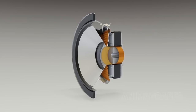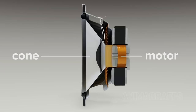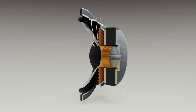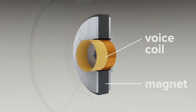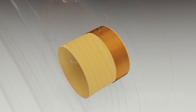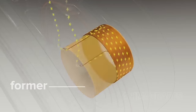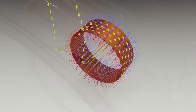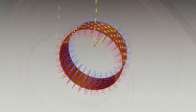Now that we've touched on the basics of speakers and studio monitors, let's get familiar with the parts of the speaker and what we call them. Let's start with the motor structure and the cone. The motor structure is what drives the speaker. The voice coil interacts with the magnet to drive cone movement. You have a magnet, and inside that magnet is a heat-resistant cylinder called the former. The former has a wire coil wrapped around it — that wire coil is called the voice coil. When you connect a positive and negative signal to a speaker, it's electrifying that voice coil.